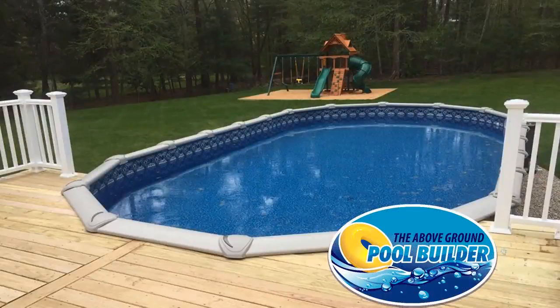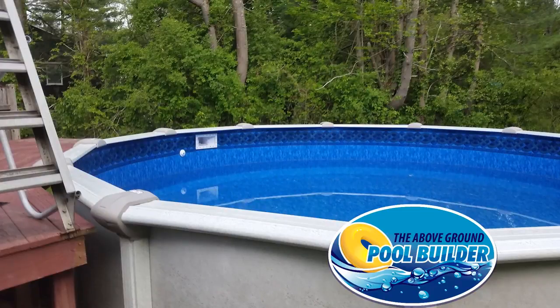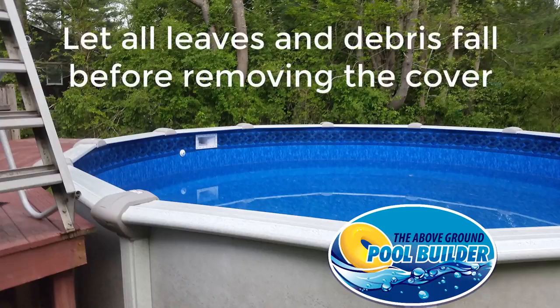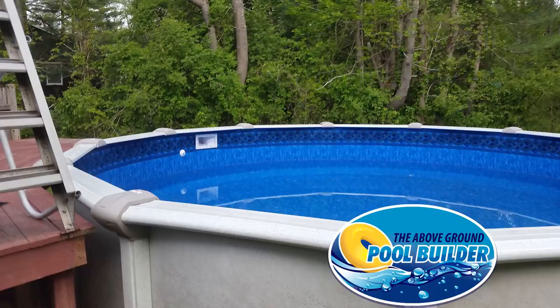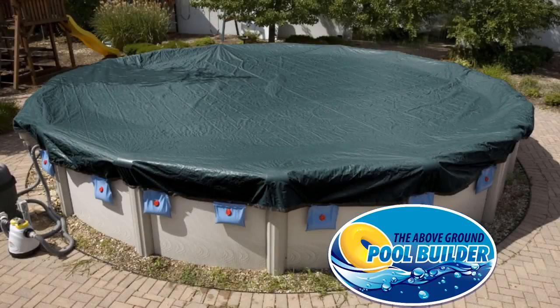A less often tried trick is to lower the water by about a full third — having two thirds or even half the water in the pool. I've seen pools with half the water in them. The trick is to let all the debris of fall come down, clean off the entire pool, and then in early December lower your pool by a third, cover it loosely, do the water bags, and you'll be all set.